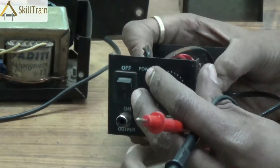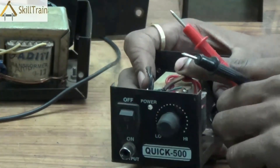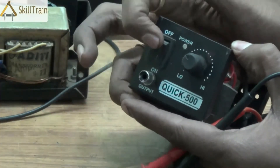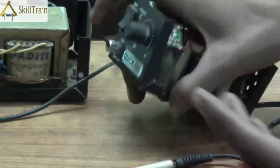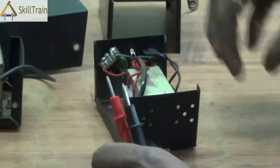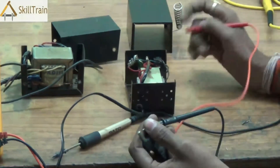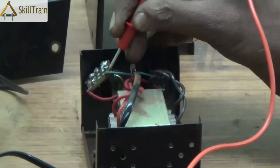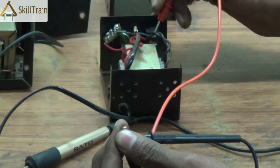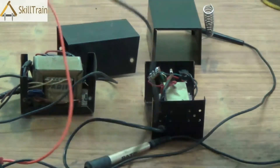As far as the voltage adjuster is concerned, you can check the tip of the soldering iron to see whether it is warming up, which will tell you whether the voltage is changing as required. In order to check the switch, you can switch it on and off and check whether there is output from the switch. If the main plug lead is faulty, you can check it by placing the two probes of the multimeter on both ends — one probe on one tip of the lead and the other at the respective connecting point. You can hear the beep, meaning that line is proper. You then move to the next lead and check — you hear the beep again, meaning the second lead is also proper, so there is no problem with the main connecting lead.